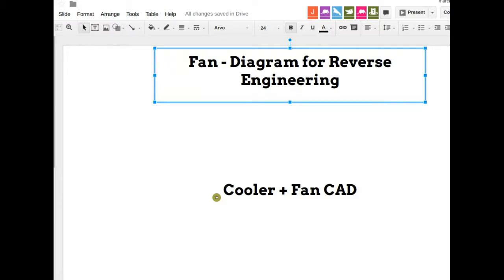What you probably want to do is weld vertical bars to the frame. That's probably what you want to weld, but then maybe attach the plate, since we're going to need to adjust that height, with the vertical bars having holes in them so you can attach it at different heights. Or once we finish, figure it out, the plate itself should definitely be removable. Because if I'm looking at this right, the bolt pattern is a square, so you could put it in slots and slide it around back and forth.